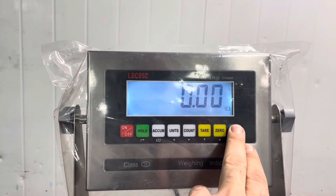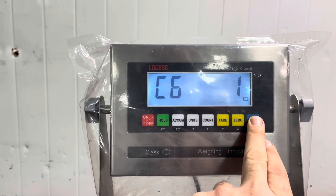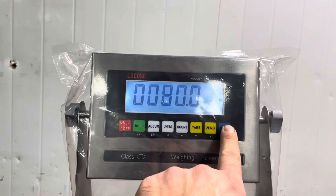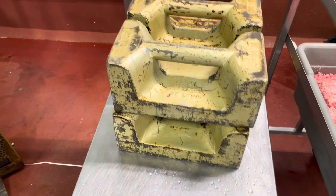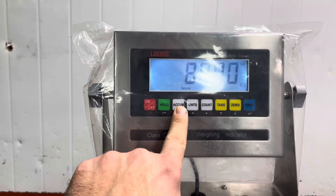After the initial count, we go to C6 and we add the weight. The weight for this scale is 80 kgs for calibration. So we jump up and put the weights on it, hit print, then hit enter, and it calibrates the scale.